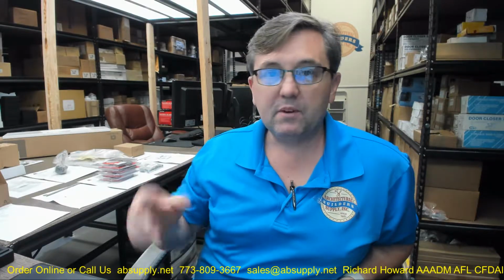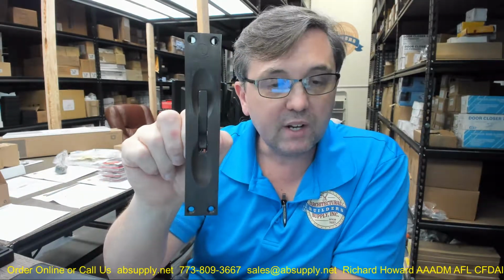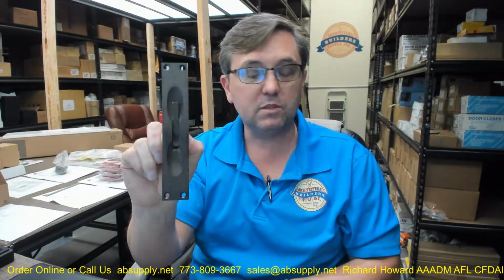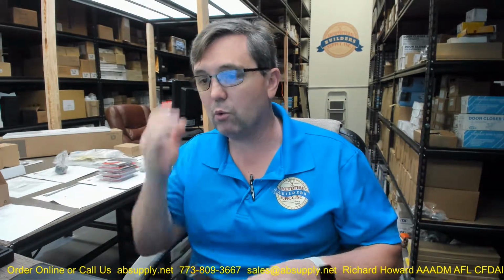Available in all of the common finishes that Rockwood can do: your brasses, your bronze, your chromes, your satin, polished, oil rubbed bronze, obviously. They can powder coat. You want black on this, they can do a black suede powder coat. They can do a Duranodic or a dark brown powder coat as well. You want antique nickel? I'm sure Rockwood would encourage you to request that. They are great when it comes to special finishes. Not special, but antique nickel, US 15A or 620 on a flush bolt face. Yeah, you can have that. I'm sure Rockwood would quote that.